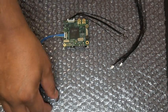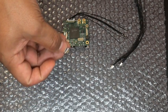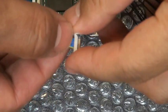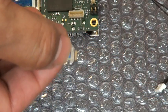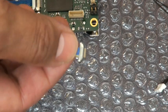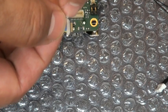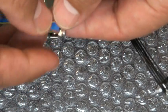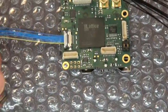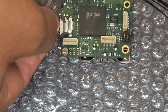I have already connected the 10-pin micro-coax cable to the interface board. However, I did want to point out that the cable is very delicate, so you'll want to be very careful when you handle this cable. There are gold contacts on one part of the connector and none on the other. When you connect this to your interface board, you want to make sure that your contacts go in with the gold contacts facing up.